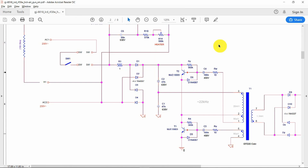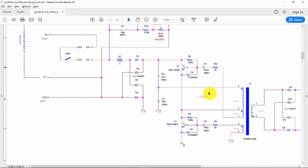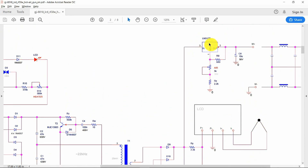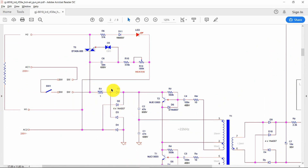I've managed to find a circuit diagram online — somebody has reverse-engineered the circuit and it appears to be correct. As always, there'll be links down in the description. This is what's not working for us: the heater at the top we know is working, but what we have here is a little switch mode power supply. Going to the right, we can see it powers both the LCD display and up here is the voltage regulator driving the fan motor. In the first instance I'm drawn towards R1, which is a 1 ohm resistor — that's definitely worth checking out.